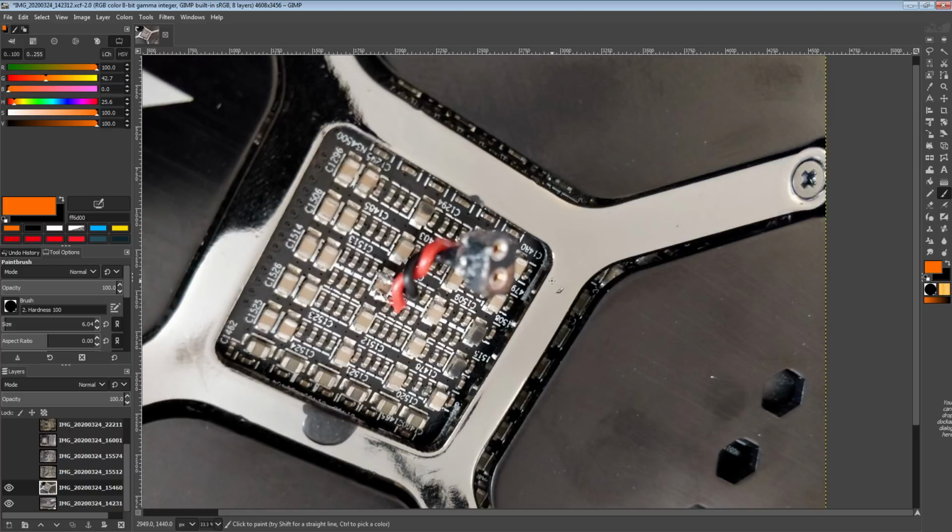So I was just like, well, we're just going to have to use the results that measure a little bit too high. I checked that, ultimately, the workaround doesn't change the relationship between the average voltage and the minimum voltage. It just lowers everything by like 10, 20 millivolts, which brings all of the measurements down into what would be an accurate voltage measurement. But I have a bunch of data measured with one method, and if I measure with a different method, now it's not comparable at all. So yeah, I hate this kind of testing.